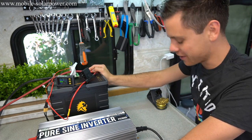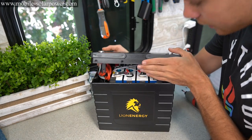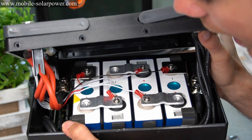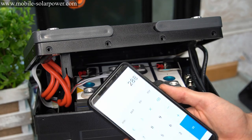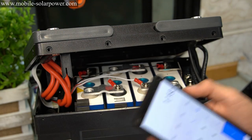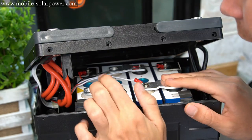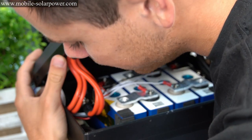Let's take this battery apart and see what's inside. It's still hot because we did that test. Look how tiny it is. We have four prismatic cells, and you can see labeled on them 90 amp hours at 3.2 volts — that's 288 watt hours each, so we should be getting 1152 max. But I'm guessing the BMS is cutting it off. There is quite a bit of heat generated on even these bus bars — I think these should be copper. When I do these tests with my bus bars, they don't get this warm. The BMS looks really nice though, it has a huge heat sink on there.